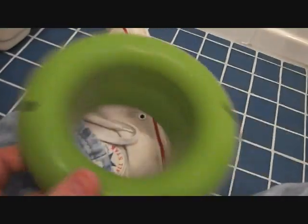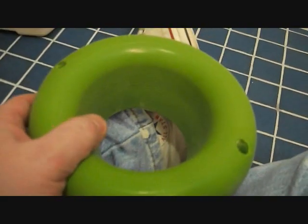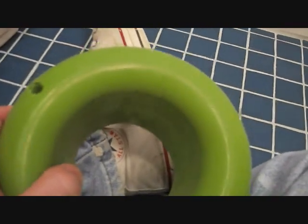Instead of a wax ring, basically what happens is that when you set the toilet down with a wax ring, the wax gets crushed, and it's hard to readjust the toilet. This, you can adjust hundreds of times. So I'm using brass bolts from Sani Seal, and I'm dropping them in. So let's do that, and this rubber flange goes in like this.